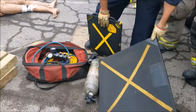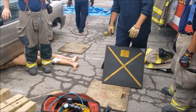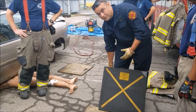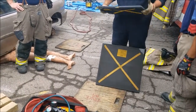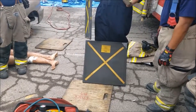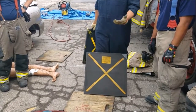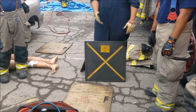There are two different styles here, which is important to note. What pressure do we inflate our airbags to? 118 to 120 PSI. This is where it might confuse you — the squads and truck 17 have these airbags that look a little different and are rated for 150 pounds. For you guys, just set it at 118 to 120 and you're good. It's not going to use its full rated capacity, but it'll still work. If you over-pressurize these bags, that's when you need to worry.